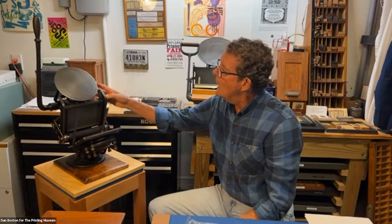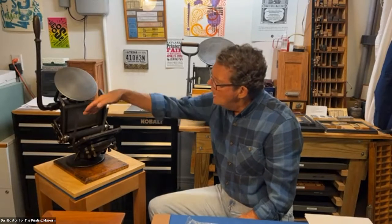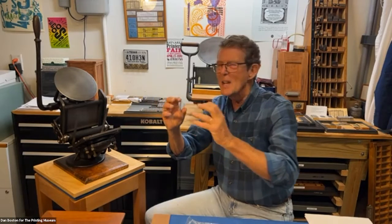In a large press, especially if they have an automatic feeder, they may print 50,000 copies of something. So those presses run and run and run. You can wear down the rails. But guess what? You're not going to wear down the type. That's changed. So the rollers are going to contact the type more and more. And you can squish ink, not just on the surface of the type, but down on the sides. And that gives a very muddy looking impression that's harder to read, doesn't look professional, etc.